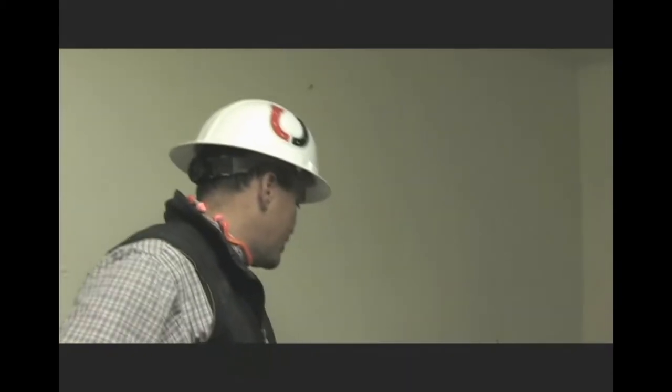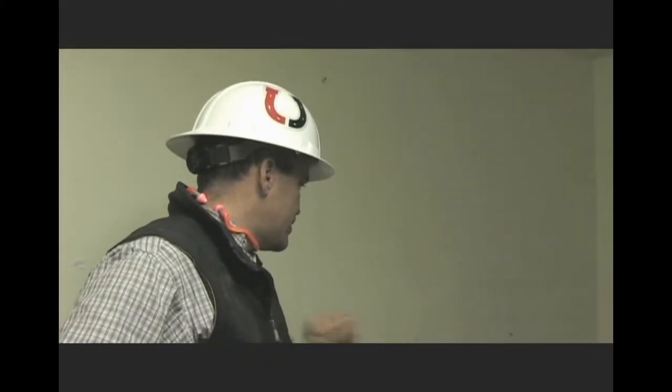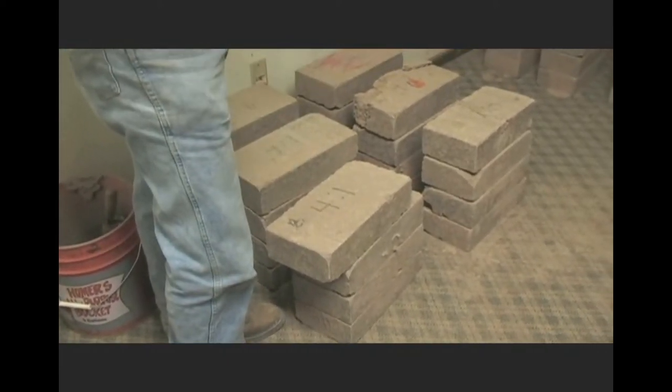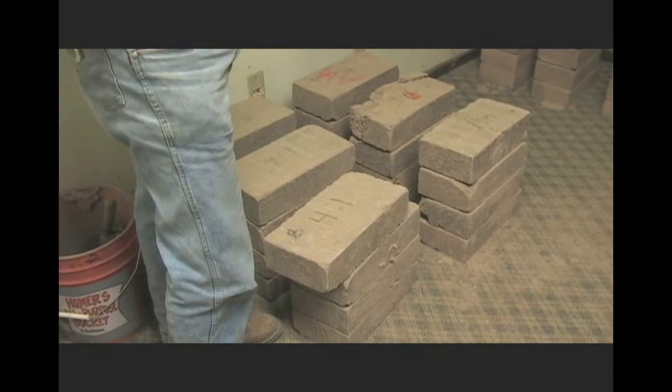Four to two — we've determined that four to two is crap. We won't use that at all. Three to two isn't too bad, but our four to one, which is the same as our block mix — I put 26 blocks on top of it and it didn't fail. University of Colorado is also doing shear tests with the slurry joints in their laboratory.